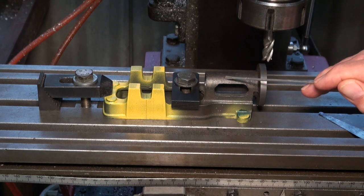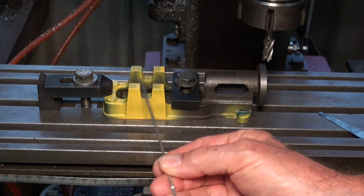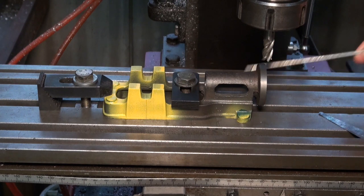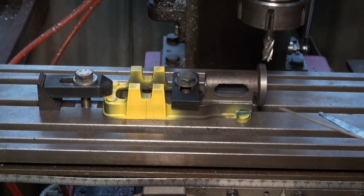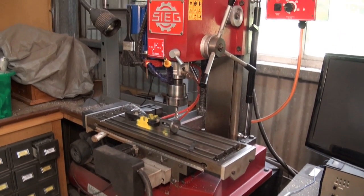In this part I'm going to show you how to machine the slots for the bearing brasses, also drilling the stud holes for the bearing caps and the hold down bolt positions which holds the engine bed to the engine base. Just for reference, I'm using a Sieg X3 milling machine which has been converted to CNC.